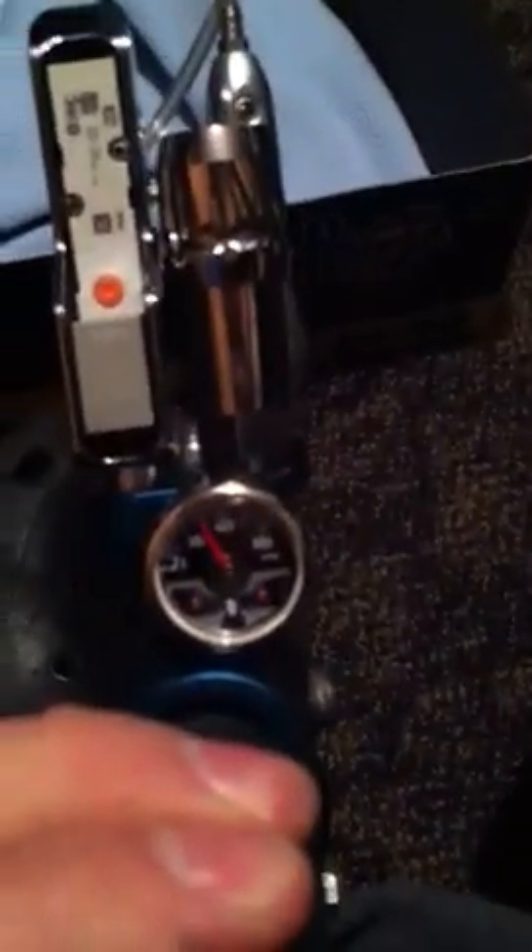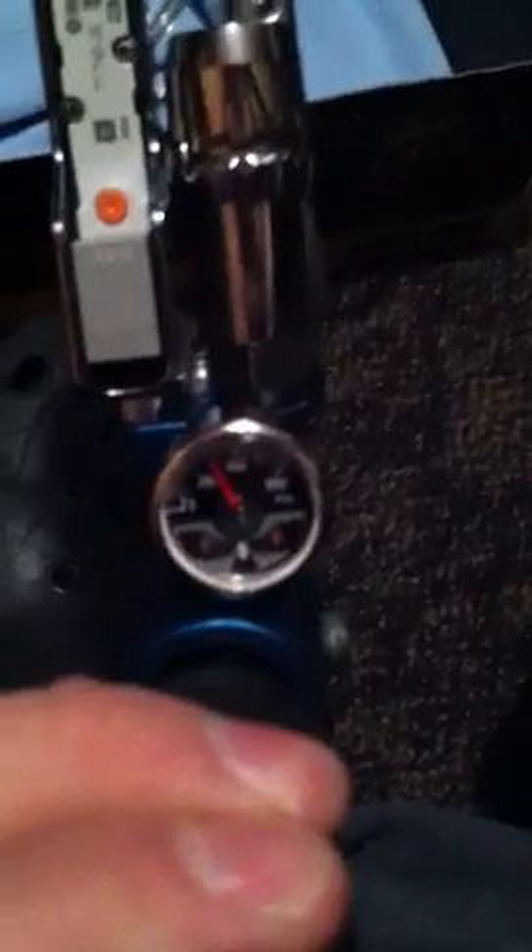You can see I have the pressure set to about 300. I already have the gun aired up and it's cocked. As soon as I adjust the low pressure, you can begin to hear the leak from the three-way, and it's coming right underneath the solenoid.